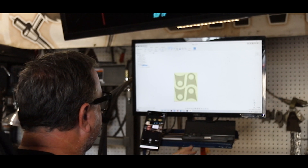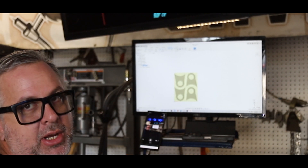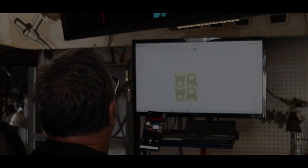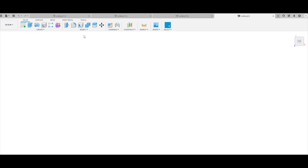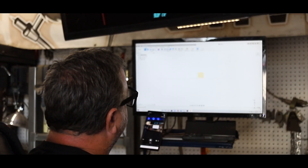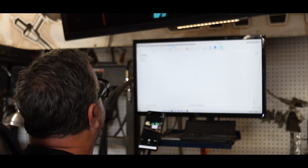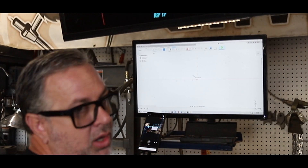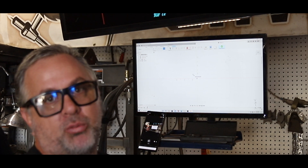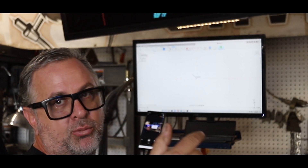I normally just leave Fusion 360 open on this computer — that way it tries to minimize the updating and it's always ready to go. I'll go up here and start a new project. Go to new design, center it, then go over to solid and click anywhere on this screen. I'm going to draw a couple of tabs. Most of the shocks we bolt on have a half inch hole, so I undersize the holes and then drill or ream them out. I have a couple of reams to make the holes perfectly accurate — I undersize them, take the die grinder to them, get the scale out of the way, and then ream them out and they work great.